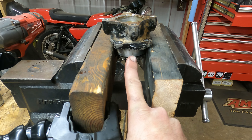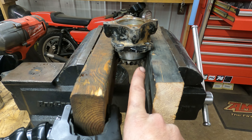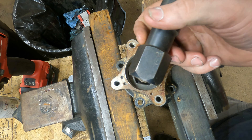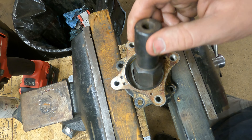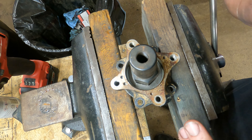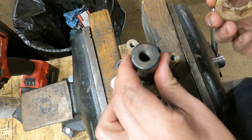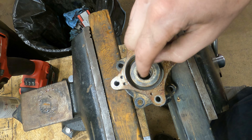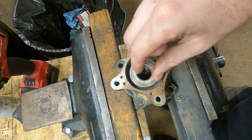Right now I've got it kind of squeezing on the gear and this round aluminum piece, but I don't have a ton of pressure up here. This looks like a nut. I don't recommend you go buy this — this is a tool for a clutch on a snowmobile and the hex actually fits pretty much dead nuts on here, which is awesome for me. For you though, what you might want to do is try to find a nut that kind of fits down in here and then stick a bolt close to this size and weld the bolt into it.